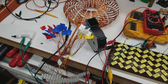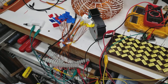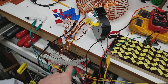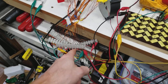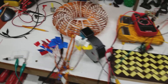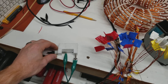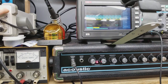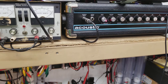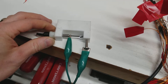Something — everything quit. That's why — I shorted out the cap. Let me move it so it'll be in line with the cap bank: bridge rectifier → coil → spark gap → cap bank → back to the other side of the other coil and back out. I can open-loop the second half of the circuit no problem. I've retuned the circuit so it's open-looped on the other side, and this gap will basically close the loop. When closed all the way I should probably tune it closed — earlier I tuned it open and it wasn't happy. Now there's a plasma going.